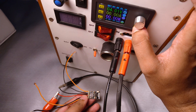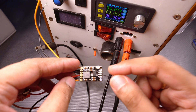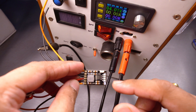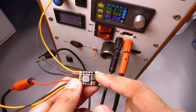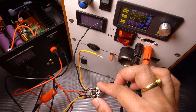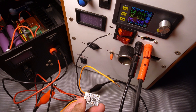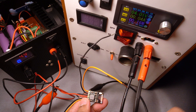If I switch it on — nothing happened. Now if I press this button once, it should switch on the boosted output. That's the boosted output on, and it shows it's not 100% charged. If I just press it twice, it should switch off the boosted output — and it does. So this part is fine. Now I am going to connect one electronic load and let's see how the boosted output behaves. I have connected the output wires to this electronic load. If I switch it on and then switch on the electronic load, it shows 0V. Now if I switch on the boosted output, it shows 5V.